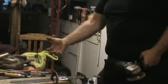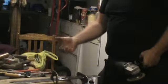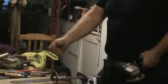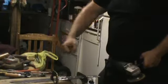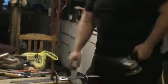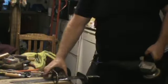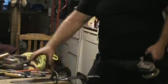all the way across. The trouble was my blower was just coming up through the middle of it, so I took the blower and blew it on top. I didn't show you that, but I blew it on top through the wood by hand to get the whole thing heated up all the way down the blade, instead of just half of it at a time, because every time you get one half tempered, the other half's not tempered.